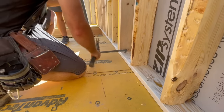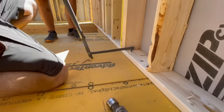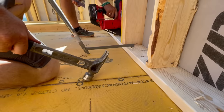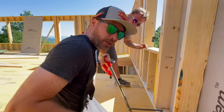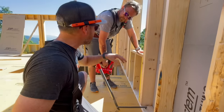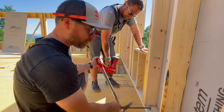Before we nailed the rest of the bottom plate to the wall, we always check it on our chalk line, make sure that it's pulled all the way in, and that will give us a straight wall surface for our baseboard and our flooring to terminate into. That's a really hard thing to do without a tool like this — you can push easy, but pulling a wall plate in, that's a trick without something like this.